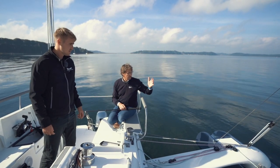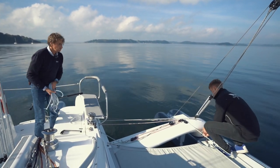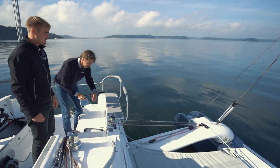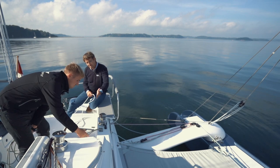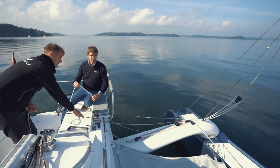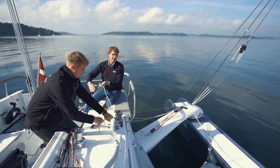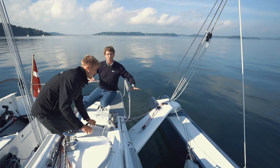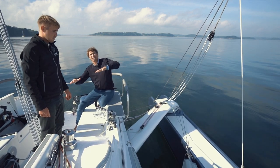Let's fold it in. Peter takes off the safety cable, then we release the backstay — be careful here because there can be a lot of tension, so have a good grip and just let it go completely. Peter then takes the fold-in line of the endless line — the inside line — around the winch and opens the clutch. Then one more turn around the winch and you can pull it a little by hand or by using the winch handle. We actually need more force to pull in the hulls because we're forcing the float under the main hull. When the float goes down, it forces the hull up, so there will be a slight angle until we have the other side folded in.